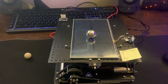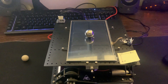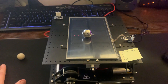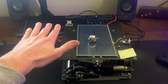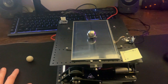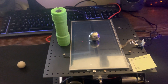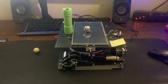We did implement full state feedback, and we also implemented partial integral control with respect to the ball's position. What that means is it's integrating the error it senses with the ball's position. We did this because we noticed there was a little bit of steady-state error without it — if the platform was calibrated in a non-level position, the ball would constantly sit off-center. Because of this, you can actually place an object on the platform and the ball will return to the center. This also works if you slowly adjust the inclination of the platform — the ball will return to the center.